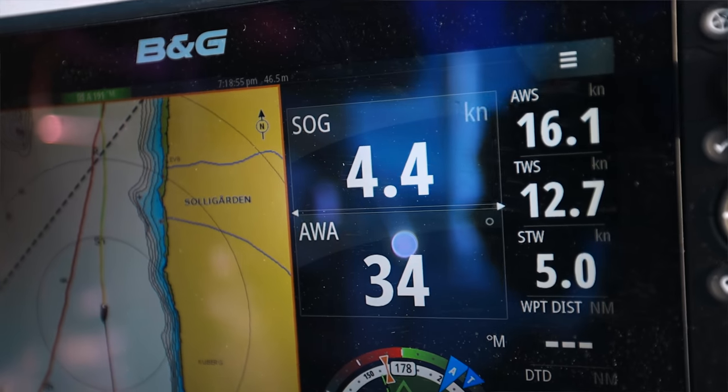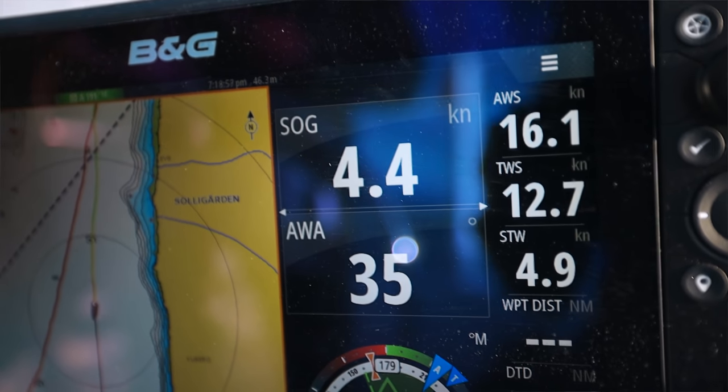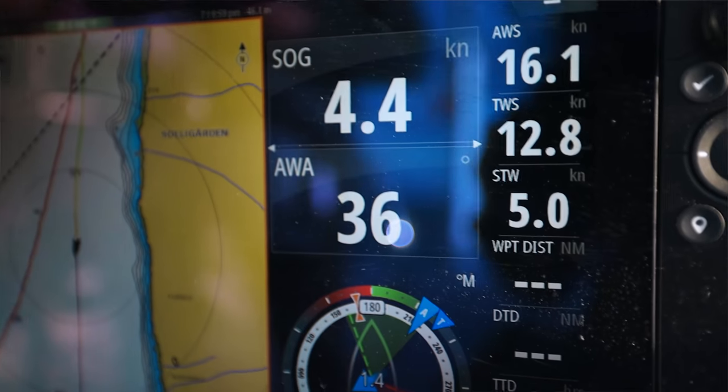All right, we have fallen off onto a beam reach, but the wind has also died down. It's only blowing 13 now instead of 20. So we're sailing along at about 4.5, 5 knots, and we're still making 200 to 250 watts of power, which is really good, actually. It means that at 4.5, 5 knots, we can cover our house loads, basically. And then anything above 5, we can actually start charging up our battery bank. That's what it looks like so far, anyway.